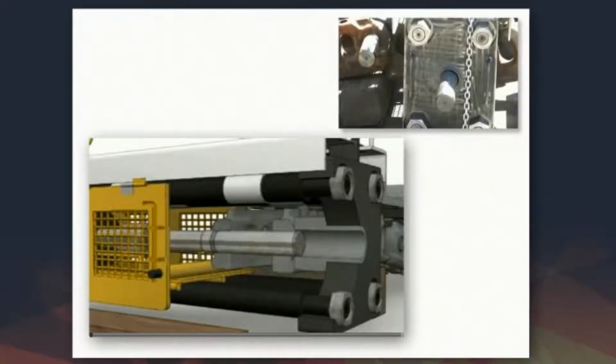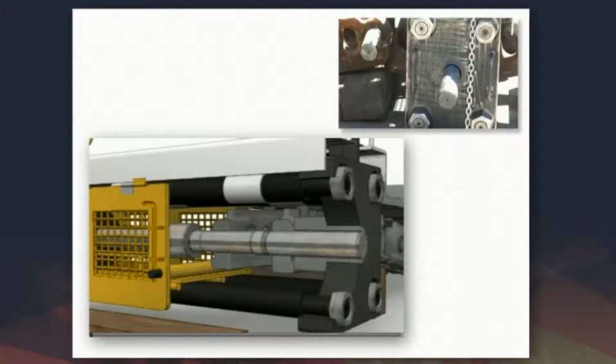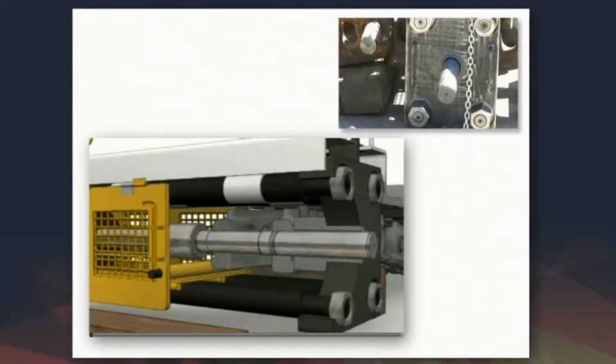During this pressing movement, the power pack gauge and press alignment should be checked at all times. At full travel of the ram, retract the ram and remove the adapter.